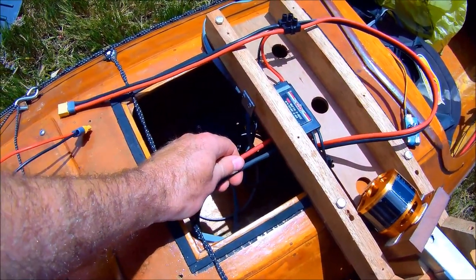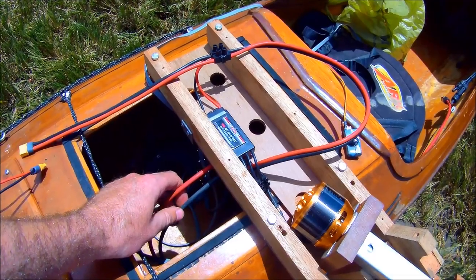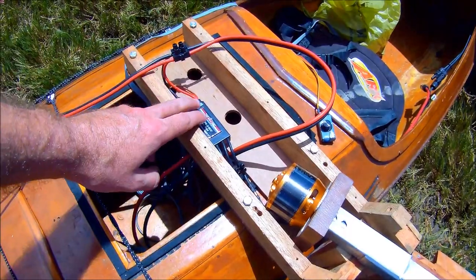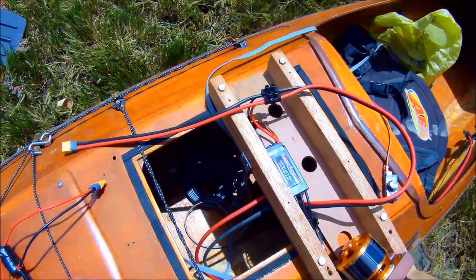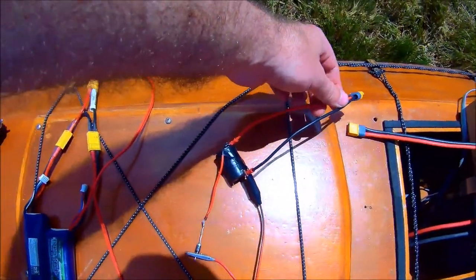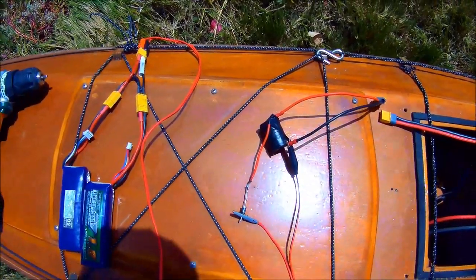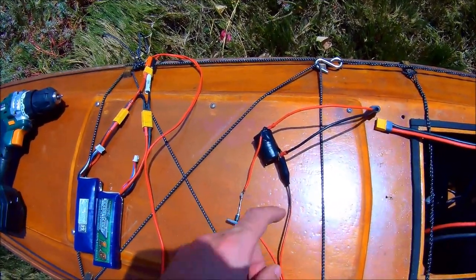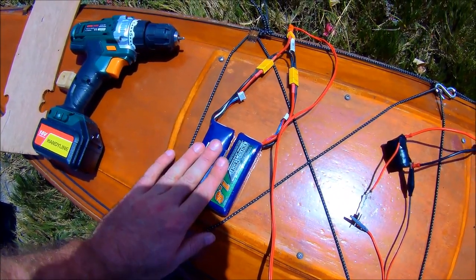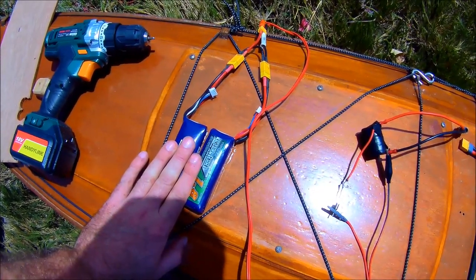Solar power wires coming in — they have yet to be connected up front at the solar panels. From there, wire out on the battery terminal of the MPPT, that goes straight into the ESC, and then in parallel with the ESC there are a few supercapacitors, and then wired in parallel with the supercaps are these two lithium polymer batteries, three cells each in series, which gives me 24 volts.